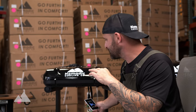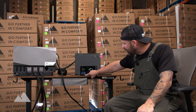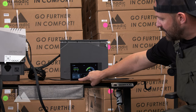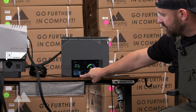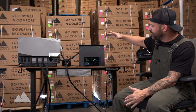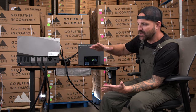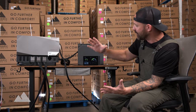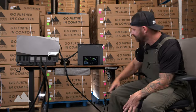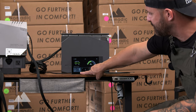We're going to turn it back on. The compressor turns back on and you'll see the amp draw slowly move up — six amps, seven, eight, nine, ten, eleven. That'll keep going up because it's a variable-speed scroll compressor. It goes up and it goes down — no hard starts, no hard stops. Right now it's at 15 amps, and as I turn it into Eco mode, all it does is slowly move down the speed of the compressor.